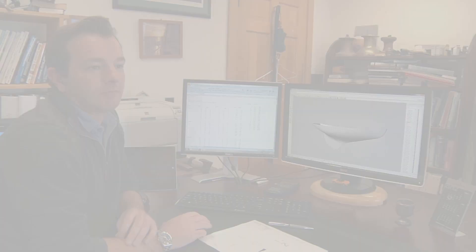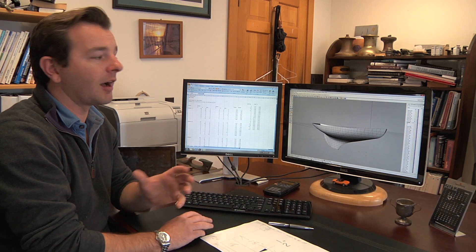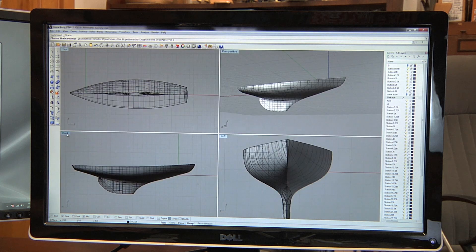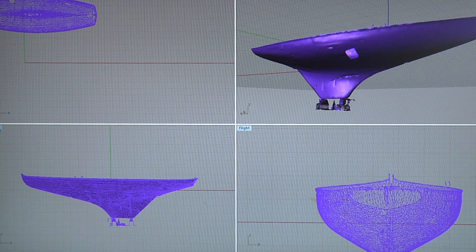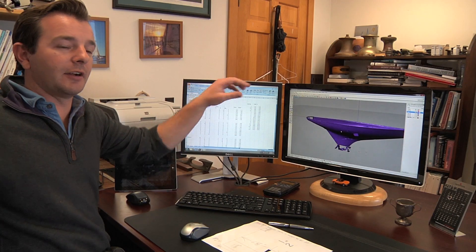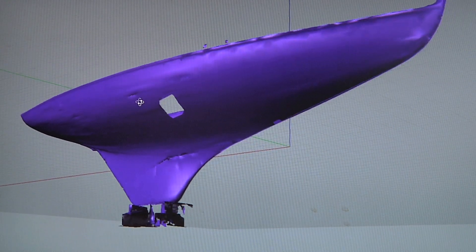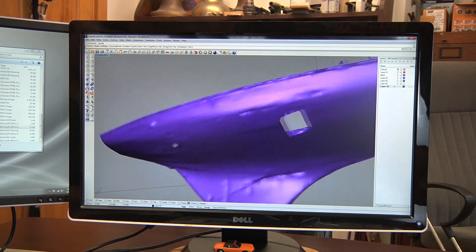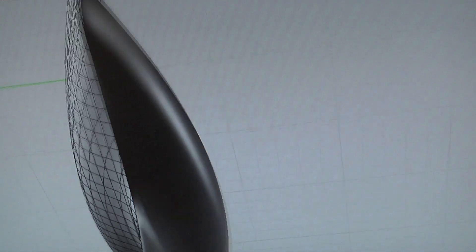In this case, we've gone a step further where we've actually, in full size, scanned the original boat to compare it and see what shape it's lost. And while this represents what the original shape of the boat looked like, the scanned boat had lost a lot of shape. Over a hundred years, the ends have dropped down, creating a flat sheer instead of that beautiful curved sheer that you would see. The 3D scan even shows us where there were hard points in the planking or unfairness in other areas. So with that information, we know exactly what has to be fixed. Here's the finished product that exactly matches the original design model — and it is our goal to return the shape of the original boat to that.